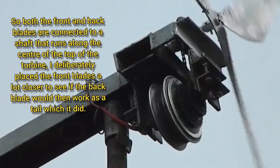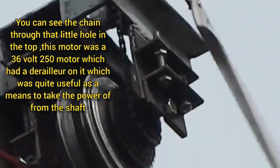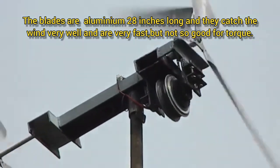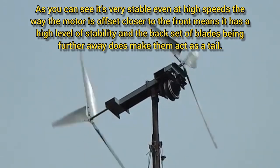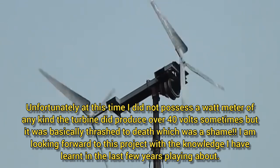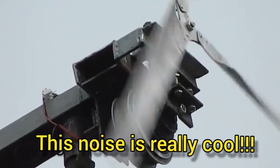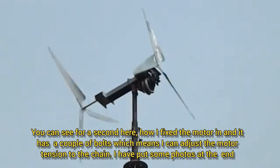That's the motor hub making the whining noise. It hadn't been spinning very fast because it hadn't turned into the wind properly, but this design doesn't have a tail. Now it's turned into the wind it's really going round, and because it's producing electricity it's making that humming noise. I'm going to do some testing - I don't know exactly how much power it's producing but I'll find out and put it in the next video.